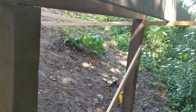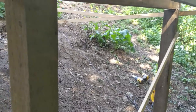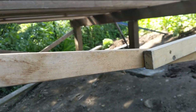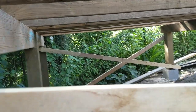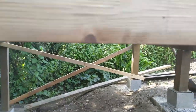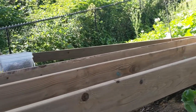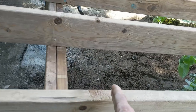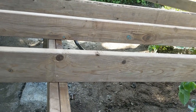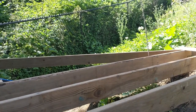You don't really need to remove them. You guys can see there I have the other brace, hold everything in that position so nothing moves. You guys can see there's gonna be some space underneath here - this is strong. These posts are about 58 inches apart from each other, so it's very strong. Two by six we do it, and then we're gonna do plywood. So this shed is gonna come a little bit past this beam in here, and the rest is just gonna be a way to walk in with the stuff. We have two doors on the shed and we need the space.